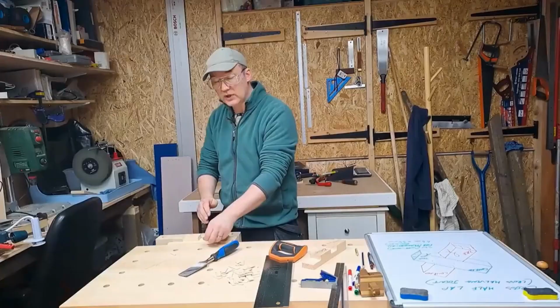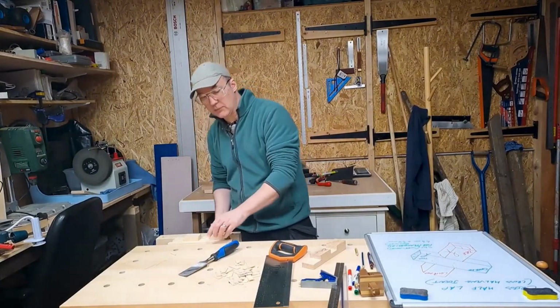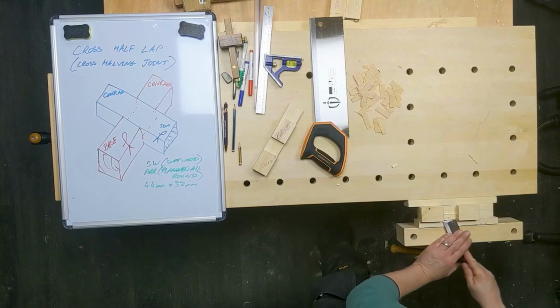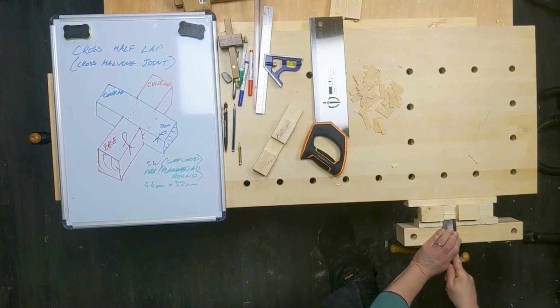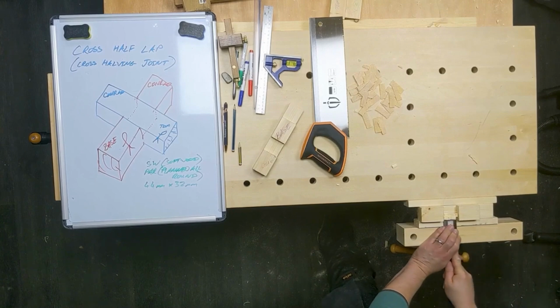So on this one, when I've put so many cuts into it as well, I'm not using a mallet. I purposely did this, trying to avoid using the mallet. It gives you better control over the chisel as you're learning, and still practices that. And the saw cuts into that really warm you up.